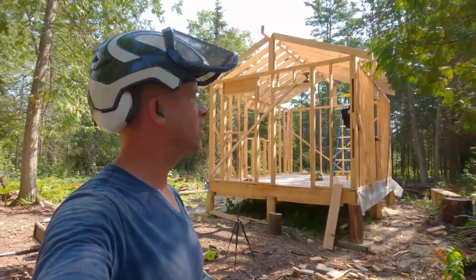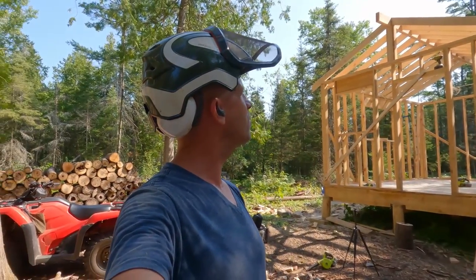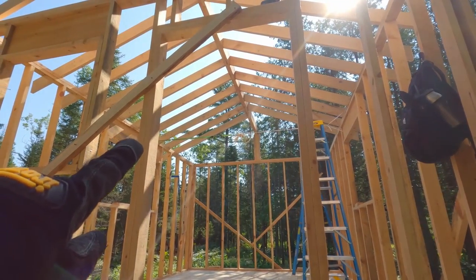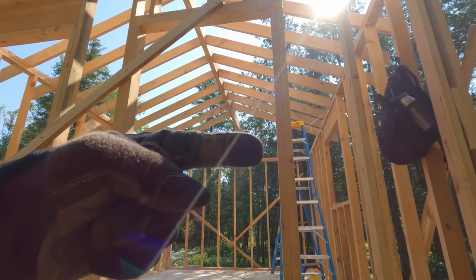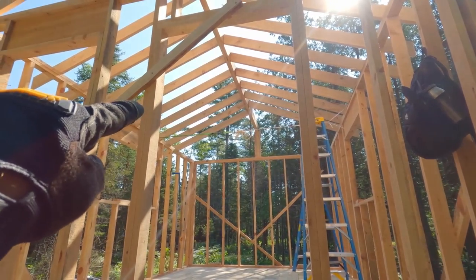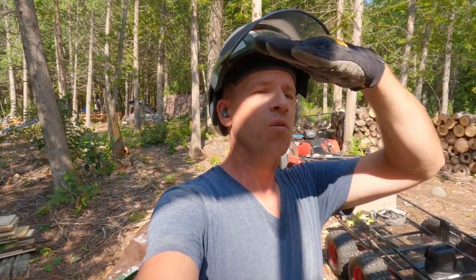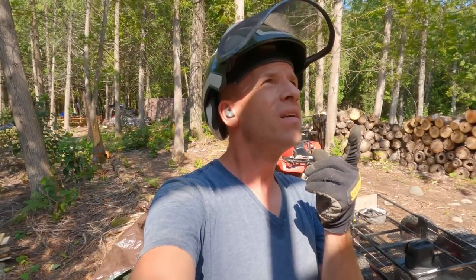Oh, you know, maybe it doesn't matter. My pile's getting a little bit thin over there. And what do I have left to frame? Still gotta put the ceiling joists. Are they called ceiling joists from here to here to connect the walls? So I think I'm gonna do that out of 2x4s probably. And like I said, they're not gonna be right to the wall there. They're gonna be up a bit, so they don't need to be terribly long. Actually, since I have 12-foot boards, maybe I'll just put them up high enough that I only need 6 footers. And then they won't sag because they're only 2x4s, and it'll only take half a board. That's still a lot that I need, and then 6 more.